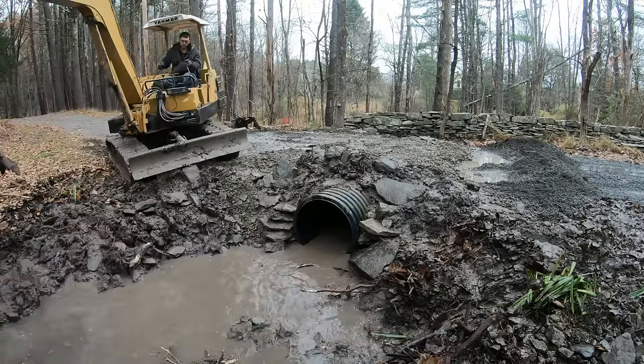Sometimes when you have stubborn potholes, just filling them up with gravel doesn't fix them. But if you put a big flat rock in them and cover them up, that usually does a much better job.